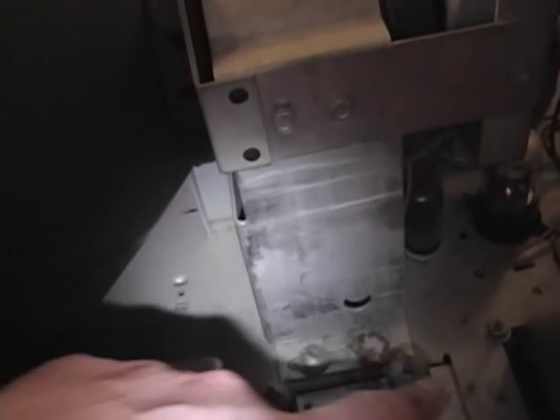It does have some rust — I thought I got lucky and there wasn't any but there are a few spots. There's the tuner. This would be the sound IF and the video IF. These sets use a split IF — one side for video and one side for audio — which can be a real pain in the butt.